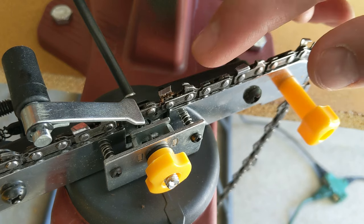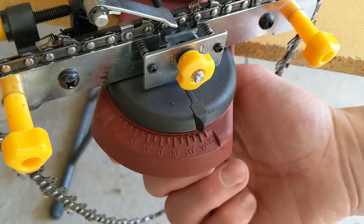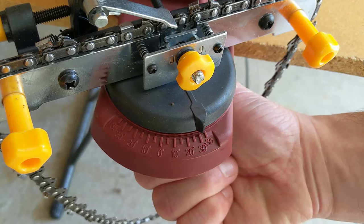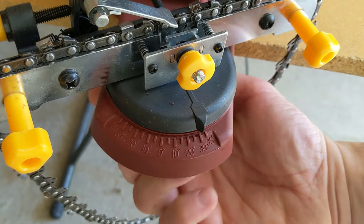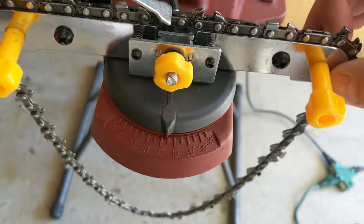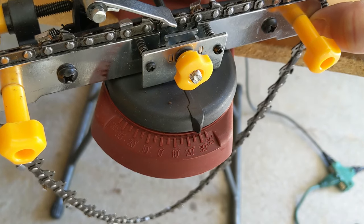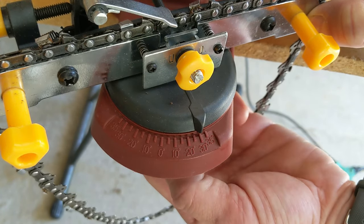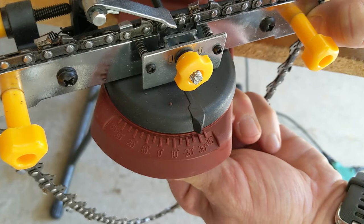You're going to want to set the vise angle at the bottom. The piece of this tool hanging off the table is the tightening knob and the vise. I'm going to loosen this vise, which gives me the option to set it to whatever angle I want. We're going to set it to 30 degrees, and then tighten that knob at the bottom so that it stays at that 30-degree cutting angle.